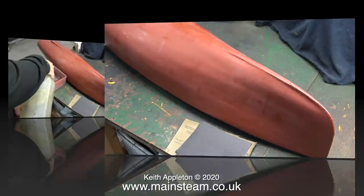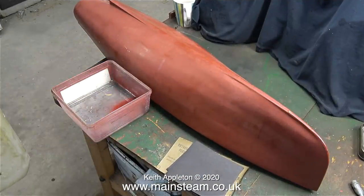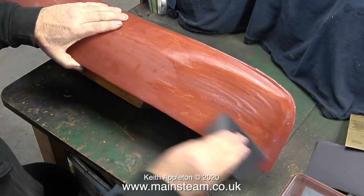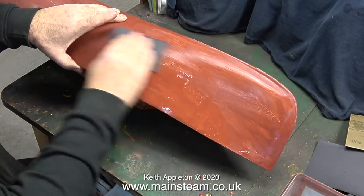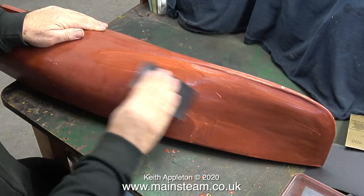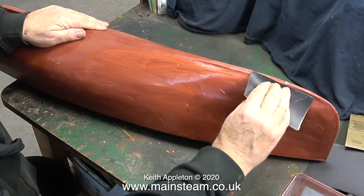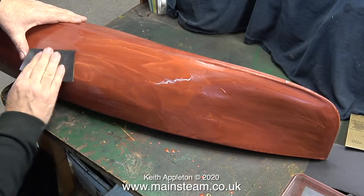What colour is the hull going to be? I really have no idea currently. It's a long time back since I started this job and I think it was a sort of a creamy colour. And the rubbing down begins — I'm using 400 grade wet-or-dry sandpaper and some water. I'm giving the hull a really good rub down and taking plenty of notice of any damage, depressions, or anything that needs filling. I've already done a lot of work on this hull — you'll have to trust me on this, it's underneath the paint.